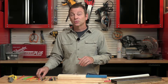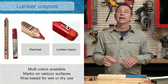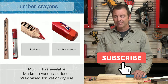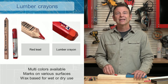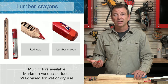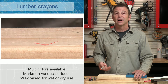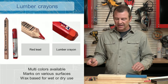If you need visibility in a marking tool, you might use a lumber crayon. These aren't just for lumber — they can mark on other materials like concrete as well. They're not that great for making guidelines, especially when the tip is difficult to sharpen. They're wax-based and they tend to show up on materials. Say you needed to mark a lot of crowns on a pile of studs going into a wall assembly — you can draw that in there and it's very visible to you or someone else assembling that wall later. These come in different colors.